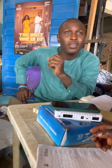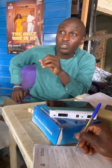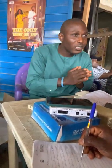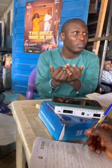Cables based on color code. The first type, we call it band stripe colors. Band stripe colors means like the one that is going right now. What you see blue, you see a stripe of blue. What you see orange, you see a stripe of orange. For every color that you see, there's always a stripe of it, and it's in pairs.